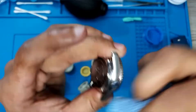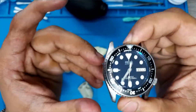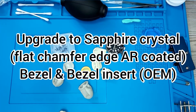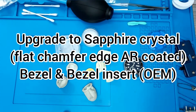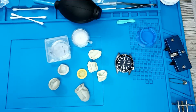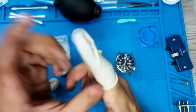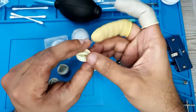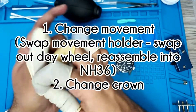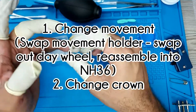If you have been following this channel, this was my first project along with the Monster Gen 1. I've been refurbing this SKX013. The things I've done to date: I've changed the crystal to a sapphire chamfered AR-coated from CT Mods, I've changed the bezel insert, and I've now replaced the full bezel. Originally the bezel was a bit damaged, so I did some rework on it, but I wasn't happy. Eventually a used bezel popped up on eBay so I bought it.